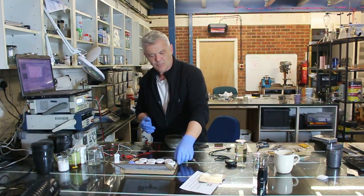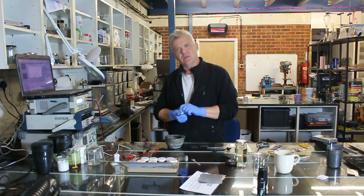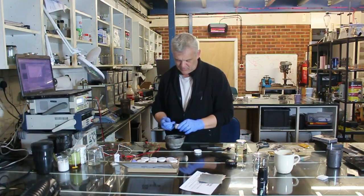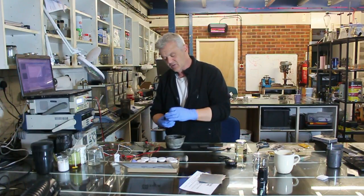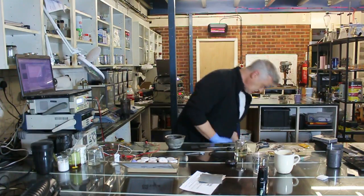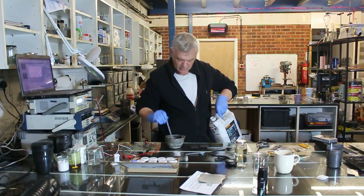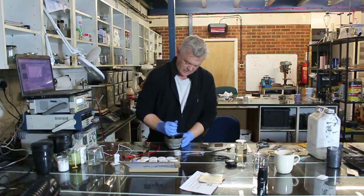With the binder, you also need something in the region of 10 to 20 percent by weight. Very small amounts of this stuff. What I normally do is when it's all in the bowl, I just dribble a little bit of binder on - there's about a couple of millilitres there, which is actually far too much. Then I'm going to mix that together. It can be quite difficult to mix because the binder gets sucked into the dry salt. So what we need to do is add a little bit of deionized water to help us mix it - about 5 millilitres of DI water - and then give it a go around.